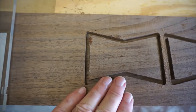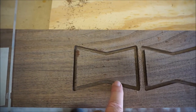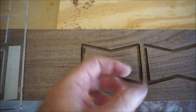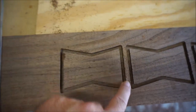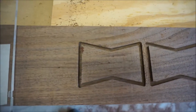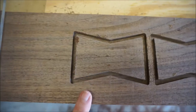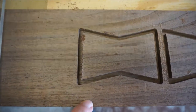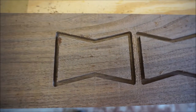What I did here is I took my time — it's funny how taking your time always solves a lot of problems. I'm plunging the bit, cutting to a corner, coming up, running the router back over it, and the suction of the router cleans up a lot of the sawdust. Then I'm coming back, coming down, and meeting in the corner. Then raising up and letting it clean out. You'll read that the router should run counterclockwise, but actually clockwise seems to work better for me. I've got this set at 24,000 RPM, which is the recommended setting.